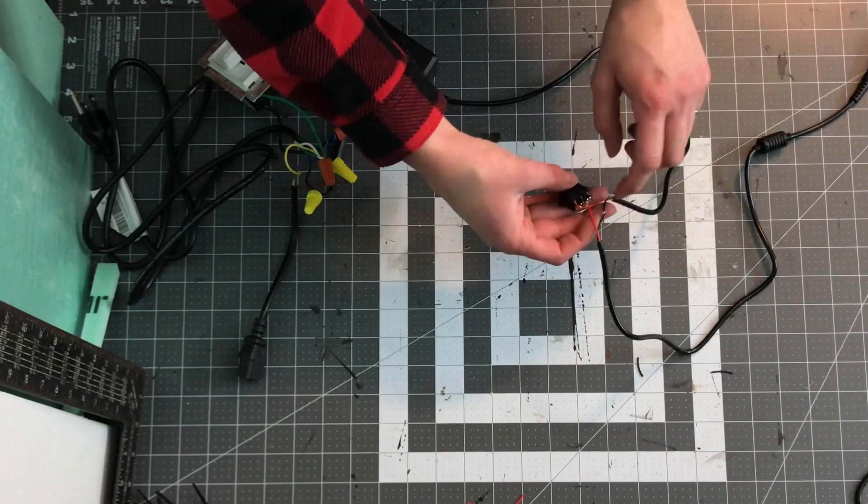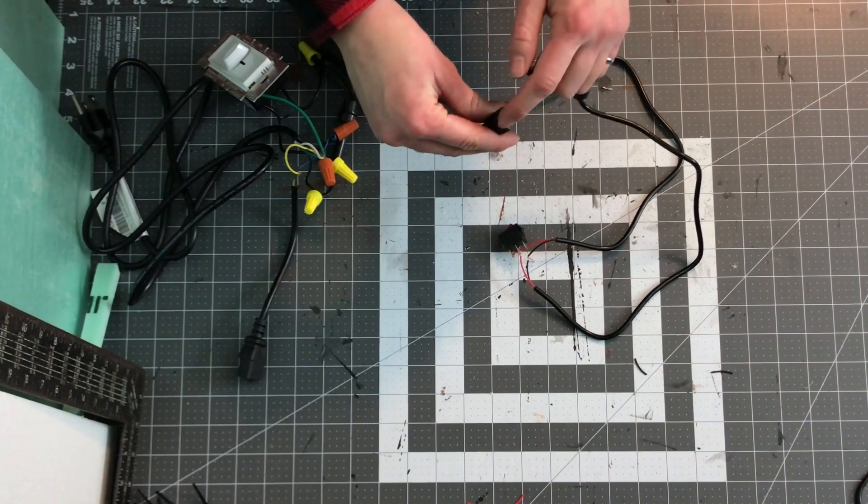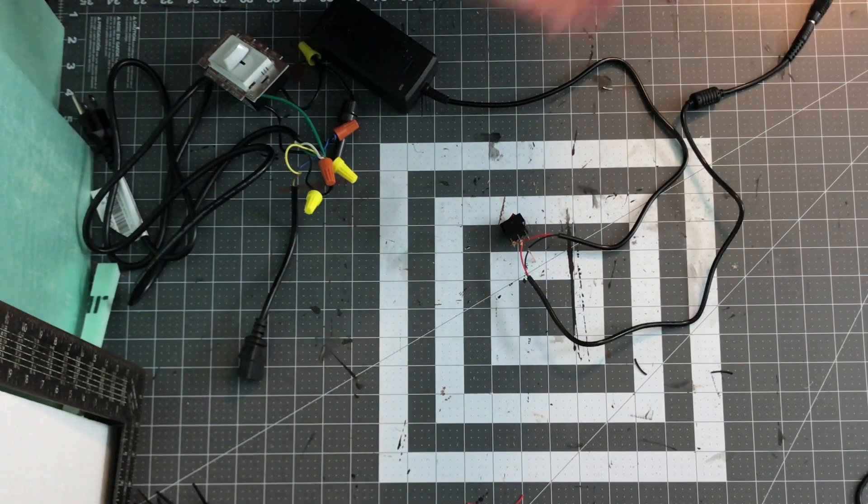The two power lines are going to get soldered to this switch, then we'll put two wires — one will go to the top of the hot wire cutter, the other will go to the bottom, and they will be connected by a nichrome wire. The dimmer switch does make things a little bit more complicated with more wiring. If you skipped that, you could just use the 12 volt 5 amp power transformer, plug it into the wall, connect it to the wire cutting portion, and good to go. I appreciate the dimmer light switch though, because it gives you temperature control. On the lowest settings it doesn't even cut, and on the highest settings it cuts really fast. That gives you control over how fast you want to cut, and if you want more detailed cuts you can go slower without burning the foam or making a wider cut than you'd like.